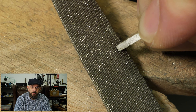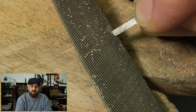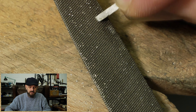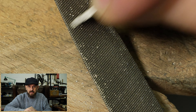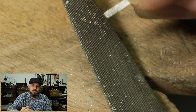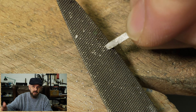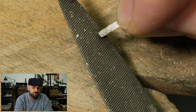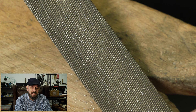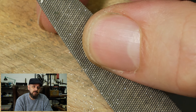You can buy brass wire brushes for cleaning files, but the only time I really use them is when welding and brushing off excess bits from steel. On jewellery files, they just don't get down the grooves. It doesn't matter if you're filing anything from fine silver up to steel — those wire brushes are just not effective. Even putting a file in the ultrasonic might clean a few bits out, but you risk it not drying properly and possibly going rusty.